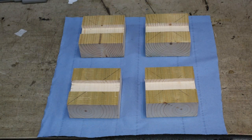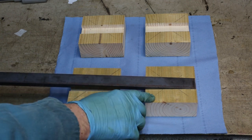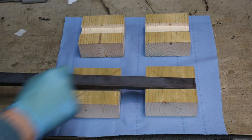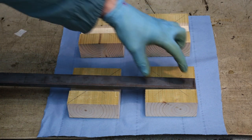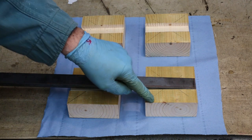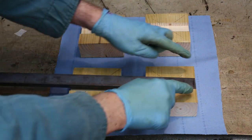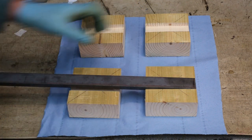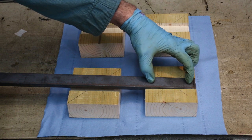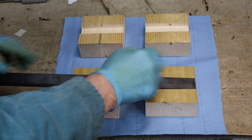Now what's next? It's adding some more strength to these four feet. We've got a slot down the centre of each of them which takes our piece of steel from the scrap bin. I'm going to cut off four pieces of this, one for each foot, so it sits in the top. In the centre of this piece of steel I'm going to drill and tap M16, and that's going to take the all-thread and carry the weight of the machine — so this bar will spread the weight over the whole width of the foot. Also, the grain of the wooden foot runs in this direction, which is important: if it ran the other way there's a chance it could crack along the grain and snap off, so the grain has to run across our load-bearing member. I'll put two countersunk holes, one each side, to hold countersunk screws that hold this in place on top of the wood. Later we may cut the corners off as well to make it look a bit nicer.